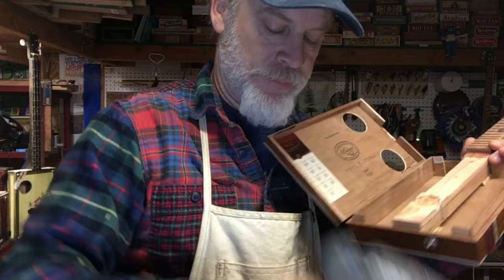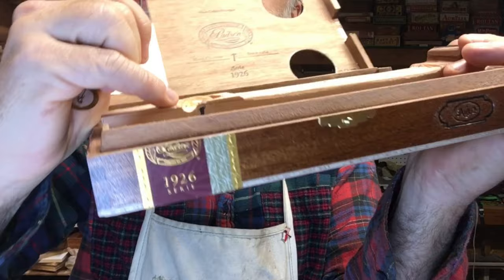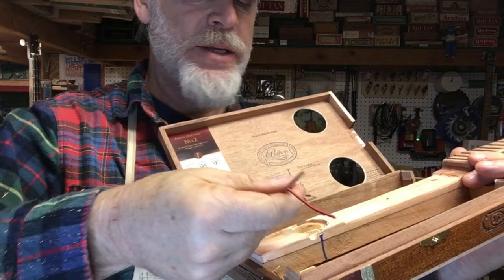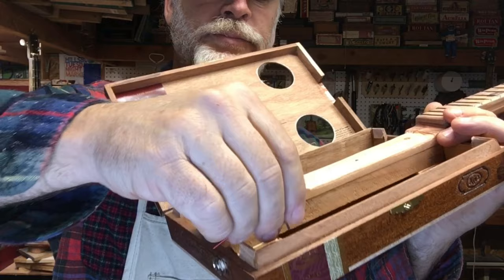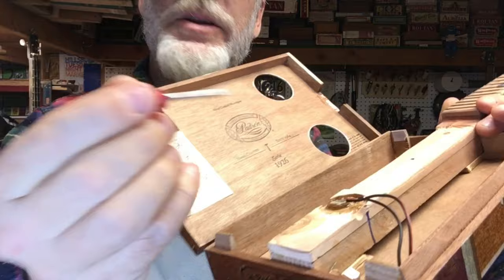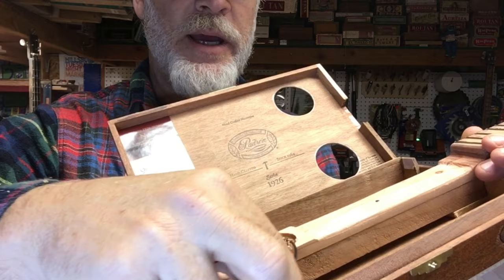And then, oh yeah, notice how I have a little trough right here. So the piezo is going to go into the hot glue, and then the leads are going to go through that little wire trough there. Again, that glue's hot, so I recommend using an implement of some sort. And you've got to be a little bit quick about it because it's going to dry on you.